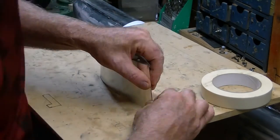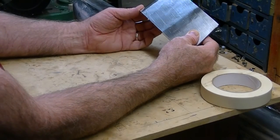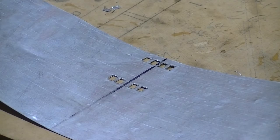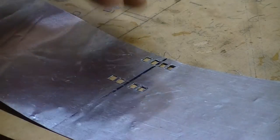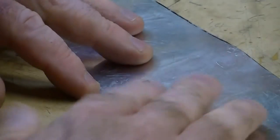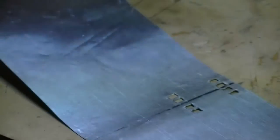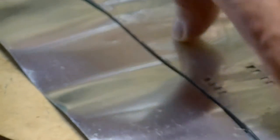That's the first try and it's pretty good — it needs a bit of trimming, but in fact it's right on the money. And of course it looks metallic. Now I've used a knife to cut the windows in here. I had to be very careful doing this because aluminium flashing sort of grabs onto the knife, so you tend to do it by just digging it in without pulling it.